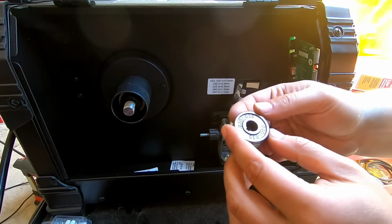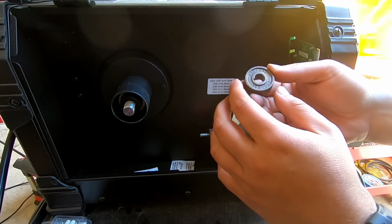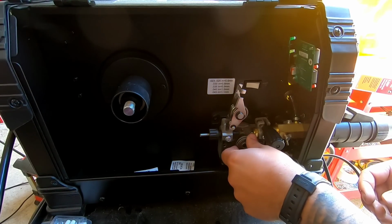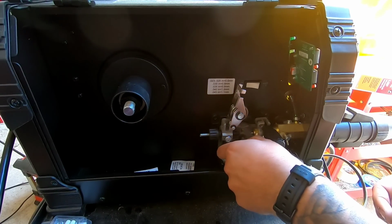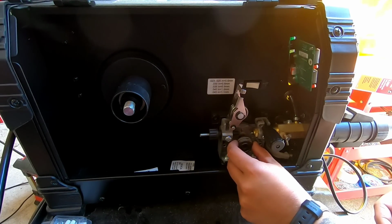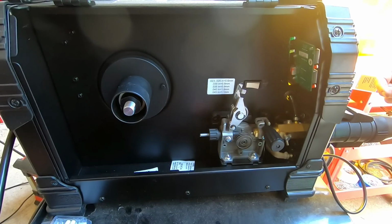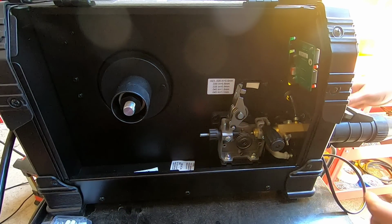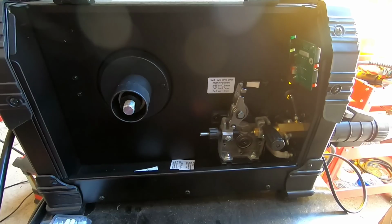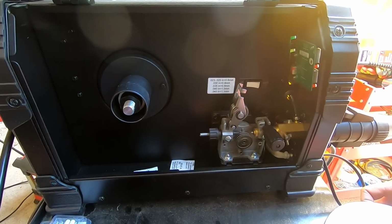But you know, on my way to Harbor Freight, I was really hoping that the kit that came with the Primeweld had a .030 roller, and you can use .030 and .035 wire on this side of the roller. So that's good, because I wanted to look at that before I left, but I'm in a rush, so I left, and I was hoping for the best. There we go. We also need to change the polarity on this, which is as simple. I'll show you switching the ground. So now that we have that, let's see. It's good to have flux core, I guess, around for jobs like this, small jobs that have some rust, paint, run through that.